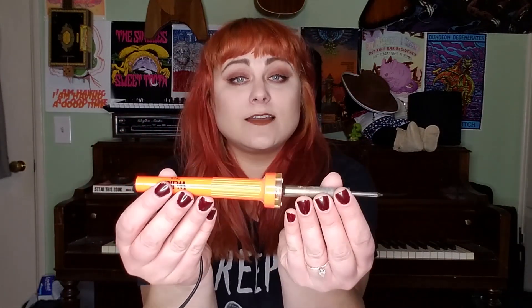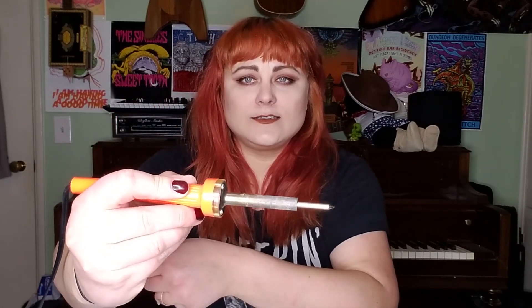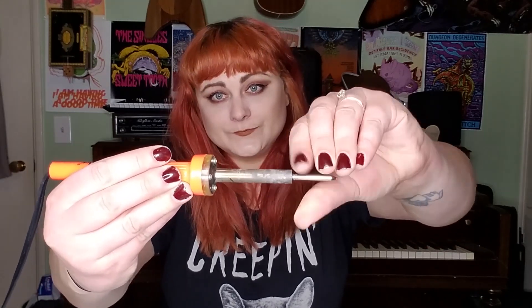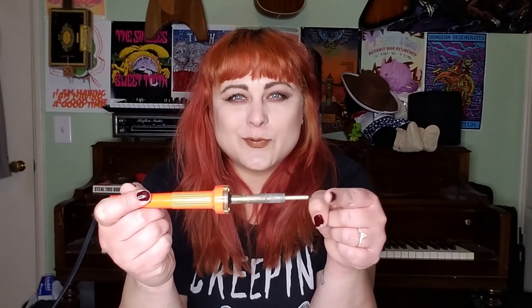You really only need the basic wall plug pen. So this is what my pen looks like — it is not hot right now, that's why I can touch the tip. It is a simple stem that you use to hold, and a tip which is replaceable. You will go through quite a few tips in your time soldering. When they get blunt it becomes very difficult to solder small things like through holes and surface mount resistors. So you want to make sure before you start soldering that you're using a good sharp tip.